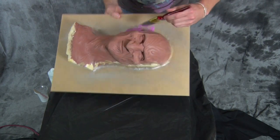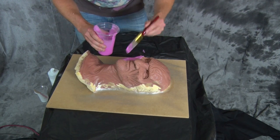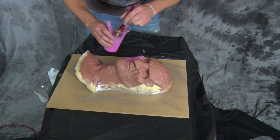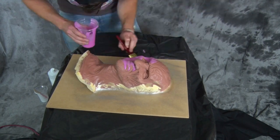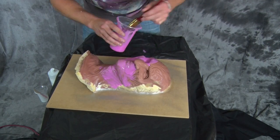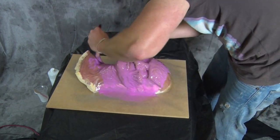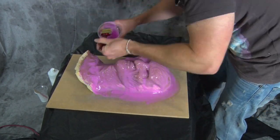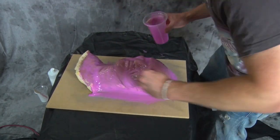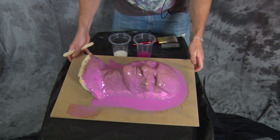You are racing against a clock with Pinky Seal or any addition-curing silicone, so you want to keep your cool and be as thorough as possible — get into all that detail, but at the same time hurry up because you are against the clock. I'm starting to build up the flange on the wooden part of the mold to get a nice thick texture, and after a quick hit with the air compressor we're good for coat number two.